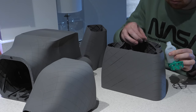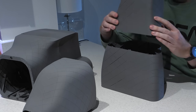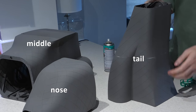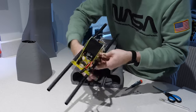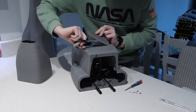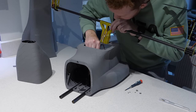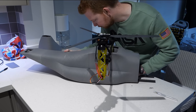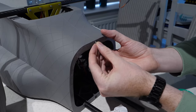After about four days of printing, I now have all the parts ready to glue together using CA glue, sometimes referred to as super glue, which was a bit of a pain as it dries quite fast. The fuselage is designed to be glued together in three pieces: the nose, a midsection, and the tail, which will eventually be held together with magnets. I then removed the wingspar and motors from the frame to install them in the fuselage by sliding the carbon fibre skids into rails printed into the design. Access at the front and rear allows me to tighten the required bolts.